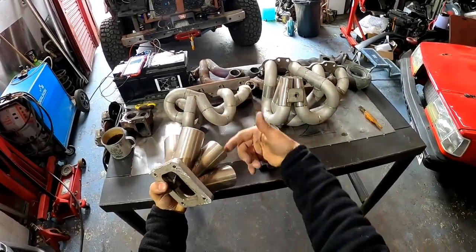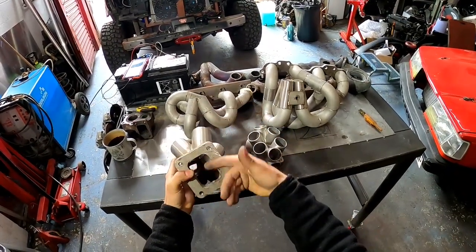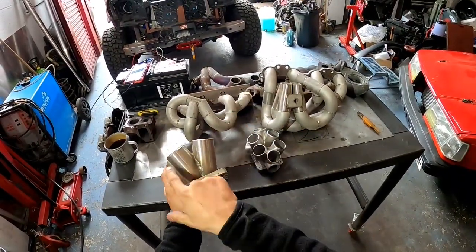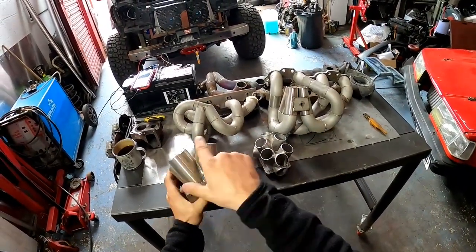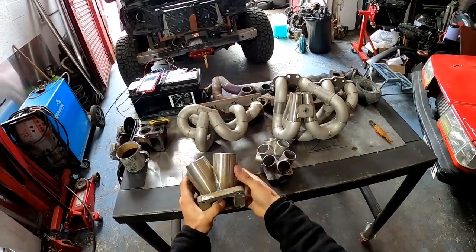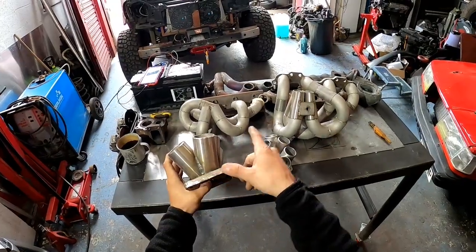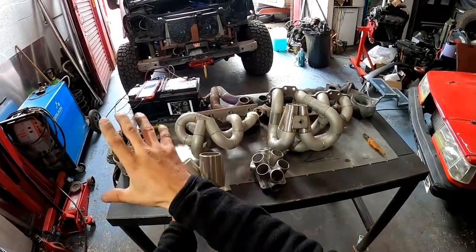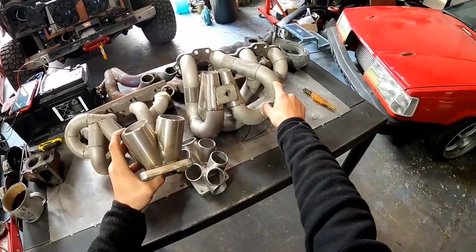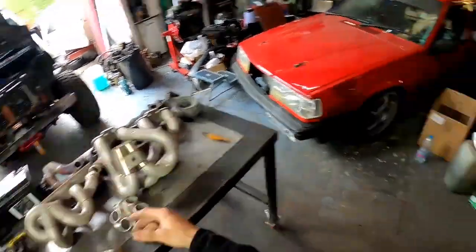So I could not use this, okay, the 1, 2, and 3 cylinders go in this direction. They will have to be put in here. So obviously it will make this merge collector much bigger, much wider. And sometimes there is an issue with the space, because when you've got these pipes here, 1, 2, and 3, you have to start doing runners, and they're pretty wide, because the radius on these pipes, as you can see, is 1.5 inch. It is pretty big, so it's going to take a massive volume.